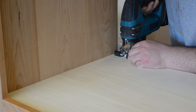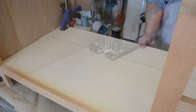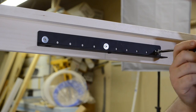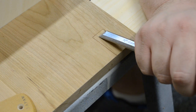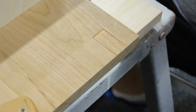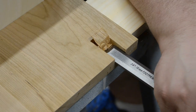Being this was going to be a TV lift cabinet, I had to cut a notch out of the bottom shelf for the mechanism, that I just did with the jigsaw. Then I mounted my top mounting bracket for the mechanism, and marked for a bottom stretcher that was going to support the mechanism as well. Then it was just a little bit of hand tool work to make the sockets to accept that bottom piece.